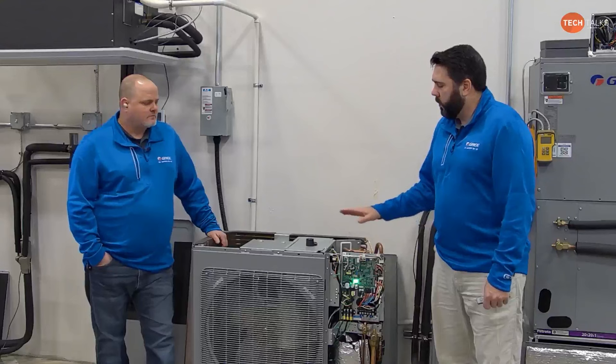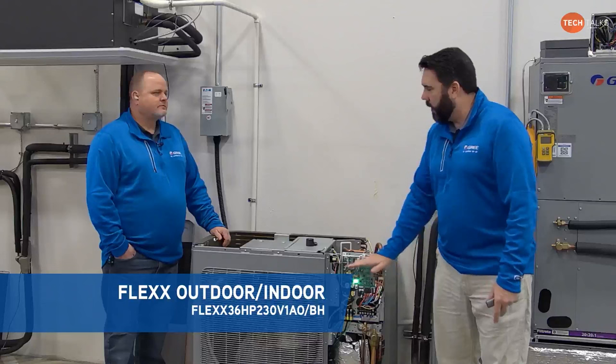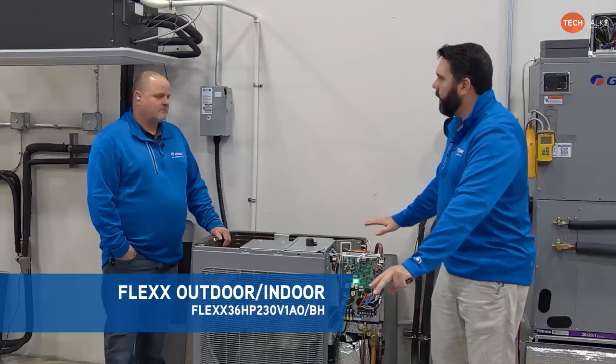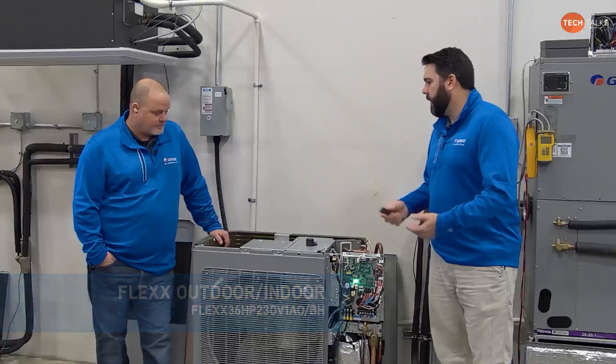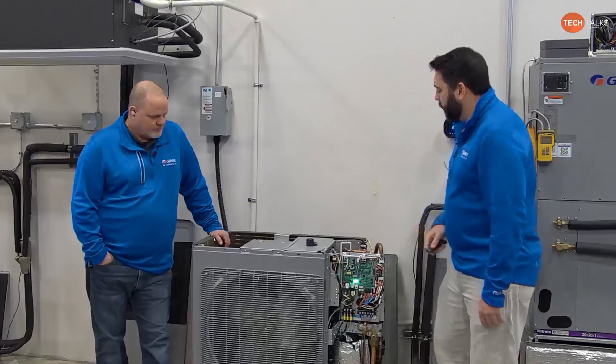So what he did was buy one of those plug-in mats that you put on the walkway in front of the door that's warmed, and he just put that under the unit and plugged it in, and that way when the water hit it, it would shed and go away instead of building up where it dripped. Oh, that's a good idea. I never thought about that. And he was asking me if he could put the plugs in there and then drain it. Yeah, that would have made matters worse. I told him that'd be worse than if it did build up underneath the unit. So, all right.